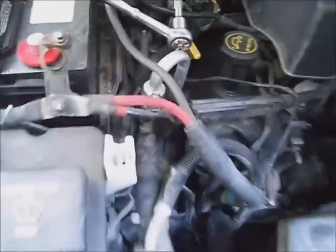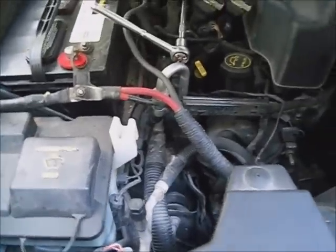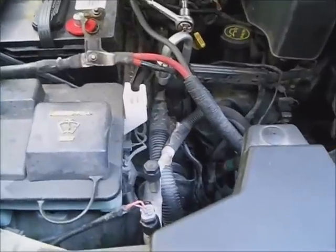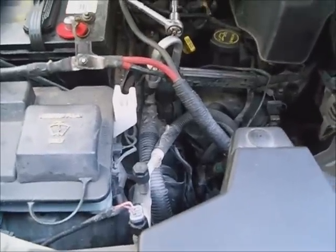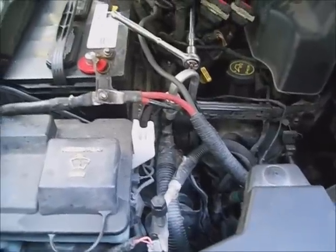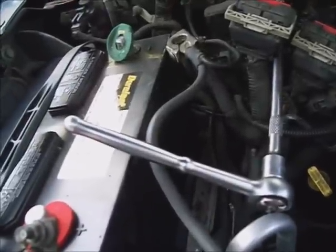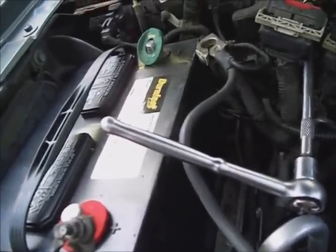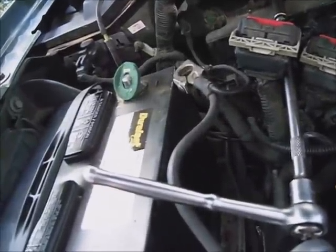The low pressure side was a little low and the compressor was cycling on and off when the back one would act up. The high pressure would only spike about 10 pounds and then the compressor would shut off. The low side was down to about 15 pounds.